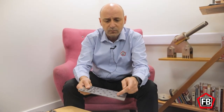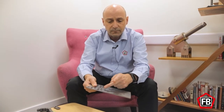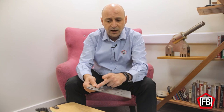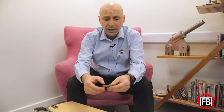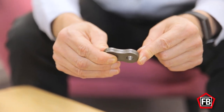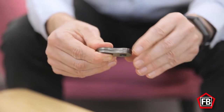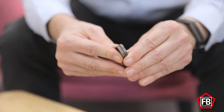We do the same — we punch the holes on the pitch, then they're shaved, the hole is then punched for a final time and we take part of the shape out, and then it's punched out a final time. We're bringing them out at a slightly different angle, and what that does is it gives us a really flat plate — it means you get a lot more area of the hole parallel onto the pin. You're increasing the surface contact area, and you can see it doesn't really matter which way round you turn these links, they're always flat.